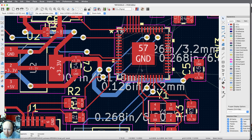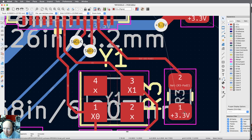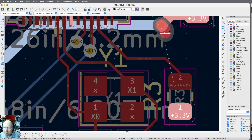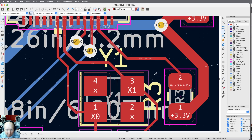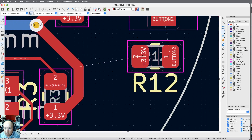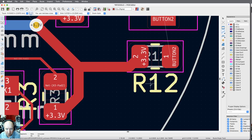I've still got a couple of traces in here to deal with, but I'm working my way up. I've got a 3.3V that goes to a pull-up resistor — I can just link that with a big trace, it won't cause any grief. On the red side, trace starting here — there's that 3.3V. We're down to 54. Another 3.3V connection there — down to 53.